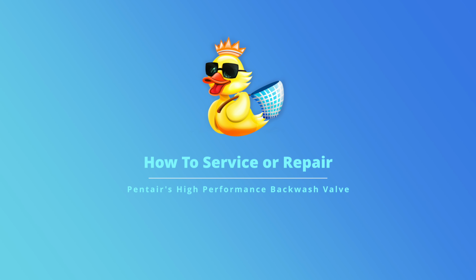All right, so the first thing you want to do is shut the pump off, which we went ahead and did. And then you also want to relieve the pressure out of the system. So that way this isn't under pressure when you go to try to take it apart. And then you see these two tabs right here. There's one on this side and one on this side, right there. All you got to do is lift up on this and then turn this counterclockwise and this lid portion will come off. So I'm gonna go ahead and get that taken care of now.